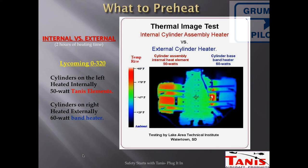That's what you're looking for in an engine preheat. Similarly with the oil — you want it to flow easily and be warm, and you want the metal sump the oil sits in to be warm too. If you leave the heaters on all the time, that's not ideal because moisture may evaporate out of the oil and float around as vapor, clinging to anything it can corrode or rust. Shield it with a good tarp, a sleeping bag, and proper insulation around the engine.